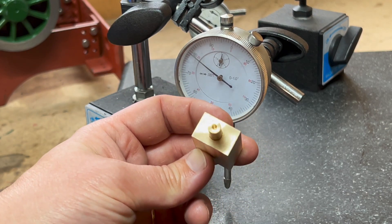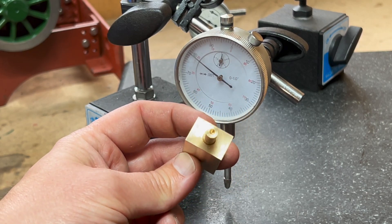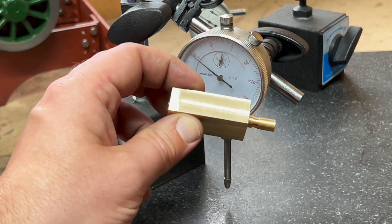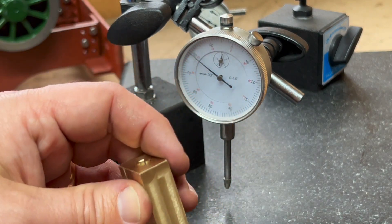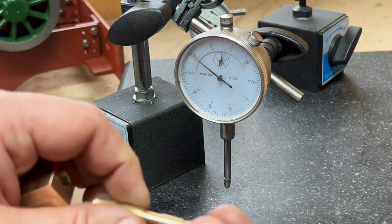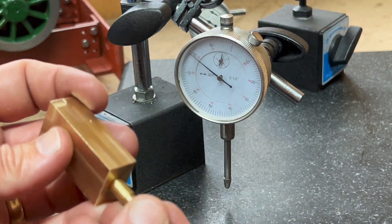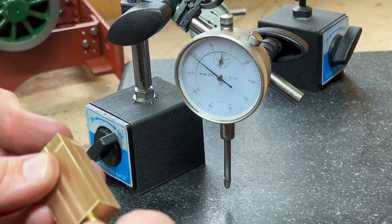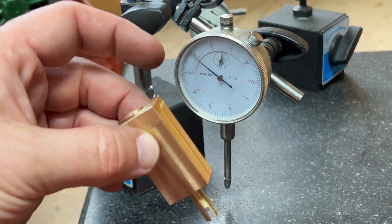In hindsight, I could have probably taken this down to within ten or fifteen thou on both sides and then shaved it as needed. As it stands, the only thing that this alignment is going to interfere with is a connecting rod and a fairly loose buckle, which I think you have to bend anyway. So given that I have to bend it and I am only eight thou out, I don't think anyone's going to be too upset about that. In general, I'm pretty pleased with how that's come out.